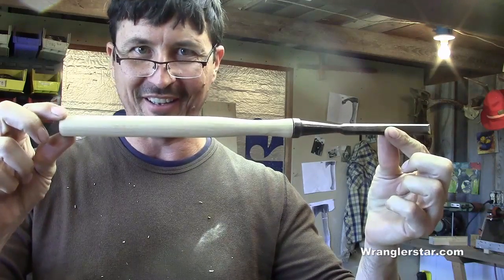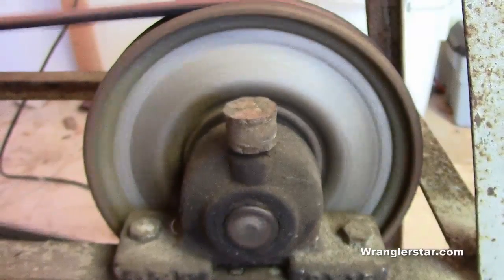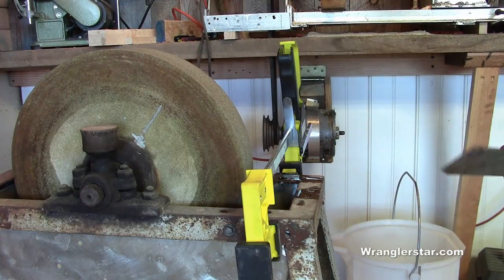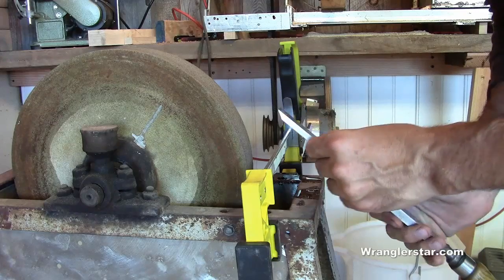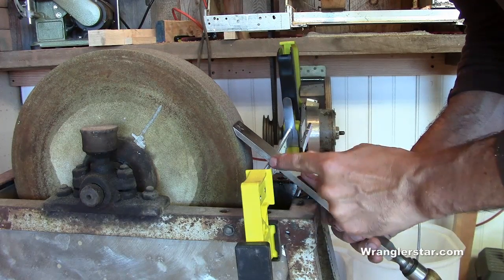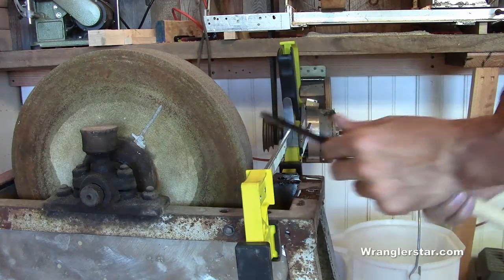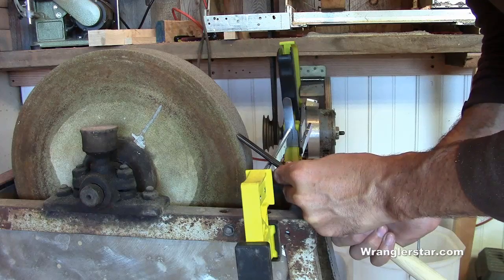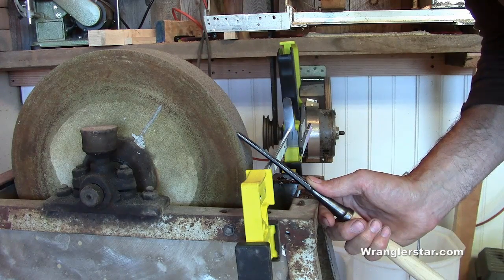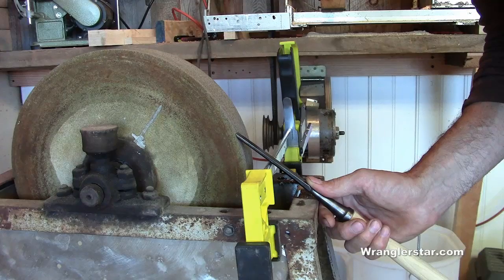Getting close — it's sharpening time. Let's take it over to the whetstone and put a proper edge on this chisel. Getting the proper angle is really important. As a guide, I've used my timber framing chisel and my jack clamp, set at a distance where I can get that perfect angle by resting it across these two points. The whetstone is the best way to sharpen tools because it doesn't produce any heat — it runs in a bath of water at a relatively slow RPM and doesn't damage the edges on tools.